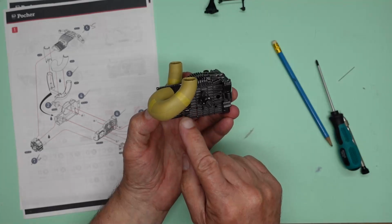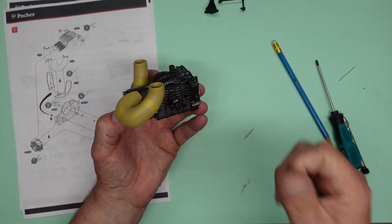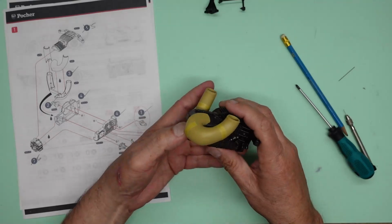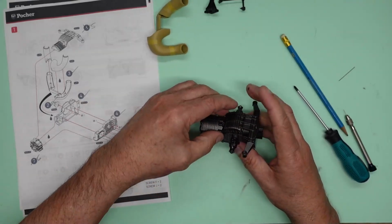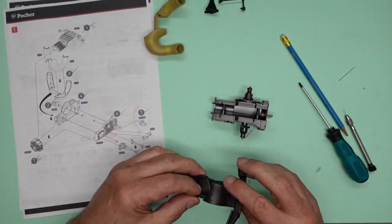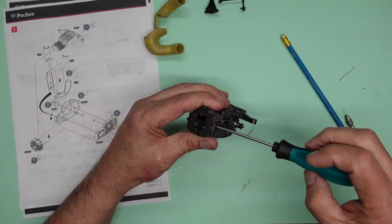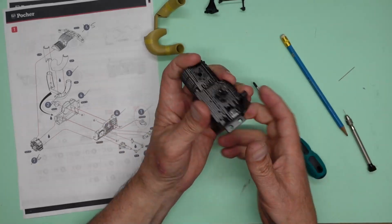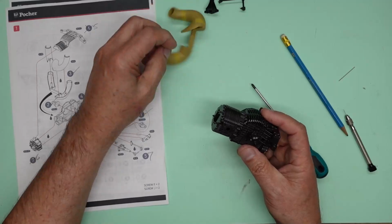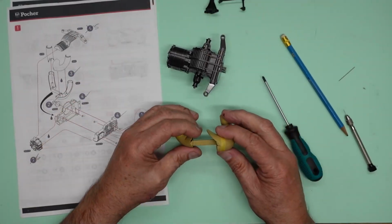Now that's great. I just put a tiny drop of super glue on there, put some accelerator on and put it together, because I know accelerator impairs the strength of the glue, so it made it easier to break away. And you can see it's only four tiny little drops on there, which I can sand off. So now, if I want to fit this on here, tighten this screw, and deal with all the seams and get it all nice, there's nothing I can do about fitting these in, unless we decide to do this. So what we do, we come in from the back side.